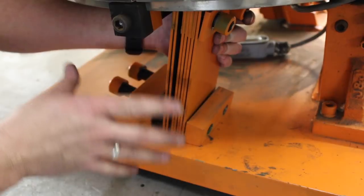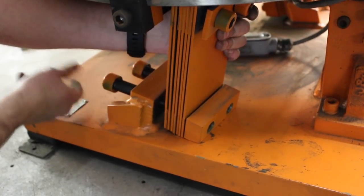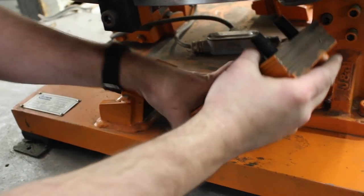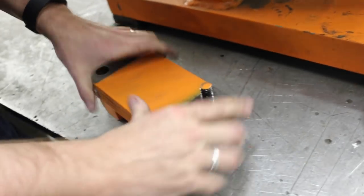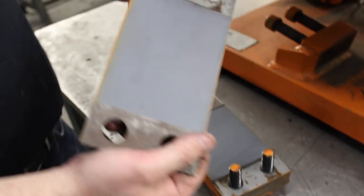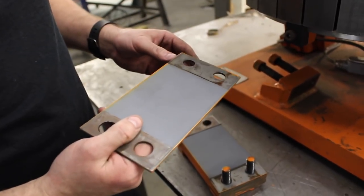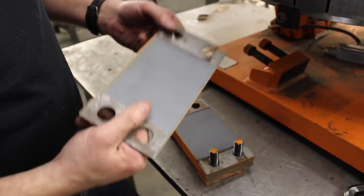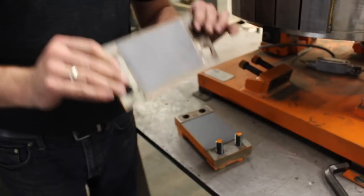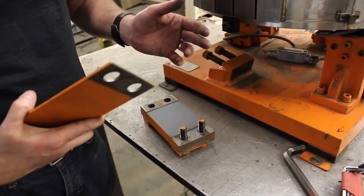I've got all the bolts loosened up and pulled out — now the tricky part. You're going to take these bolts out on this particular style unit and pull this forward. You can see this unit's been in the field for a little while. All these are spring steel. One good trick in the industry: when you take them off and you've got a unit that's slowed down on you and hasn't sped up, you want to take each one of these and hit them against the table. Believe it or not, if they're cracked they can be cracked and still held together and you just can't see it — but when you bang them on the table they'll break right in two if they're broken.